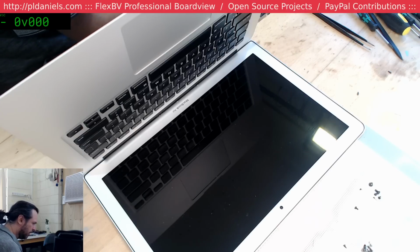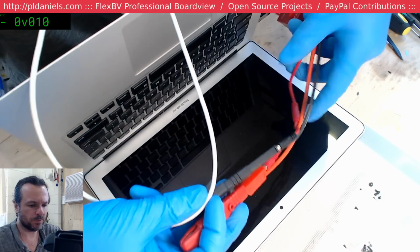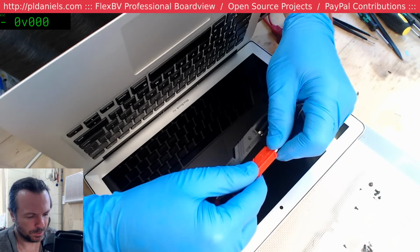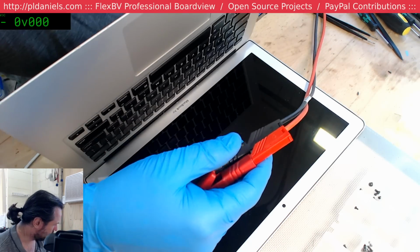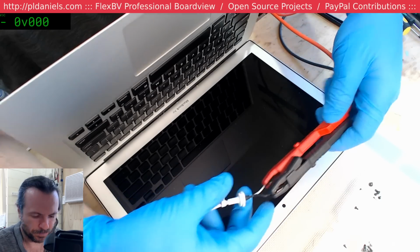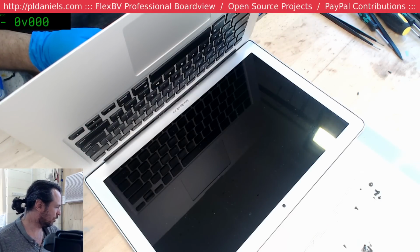I worked out how I ended up blowing up my iPhone Octopus system, by the way. Normally out of the DC power supply, I've got these alligator grips, and whatever I want to connect up, I just plug into the back of them. I think what happened is somehow I managed to put this Octopus unit onto the power at the same time. So I had the MagSafe connected up like this and the Octopus plugged in on the back of them. Now that Octopus strap is only rated for around 6 volts before the fuse dies, and so I put 18 volts in, and that killed the fuse.